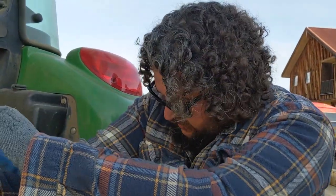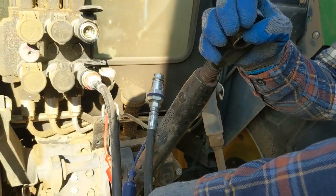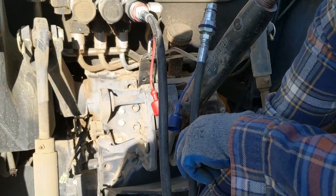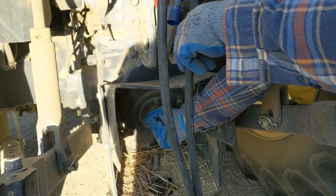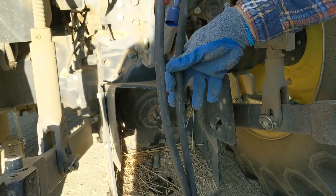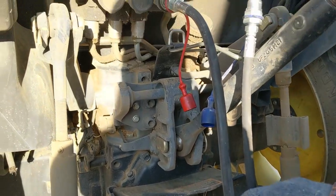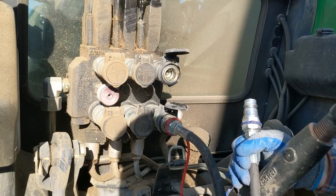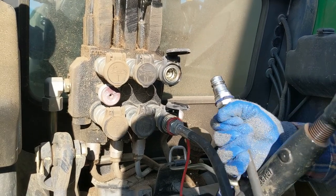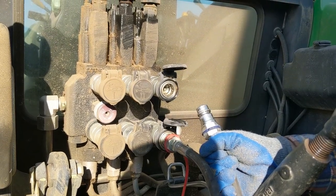These are the basic components of any tractor. You have your three-point hitch that connects and secures different machinery to the tractor. This is your PTO drive — there's tons of machinery out there that will run off the PTO. It's basically a turning bar. A regular trailer hitch and then all of your hydraulic components — built-in hydraulic controls that can power all kinds of machinery, including all the lifts on this.